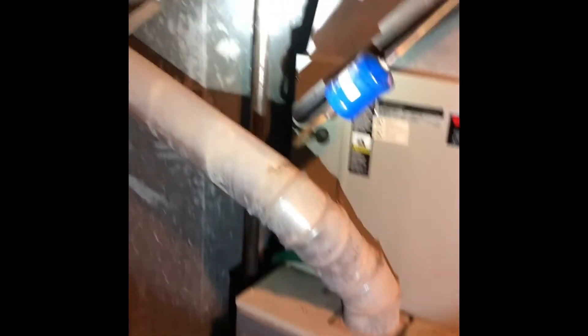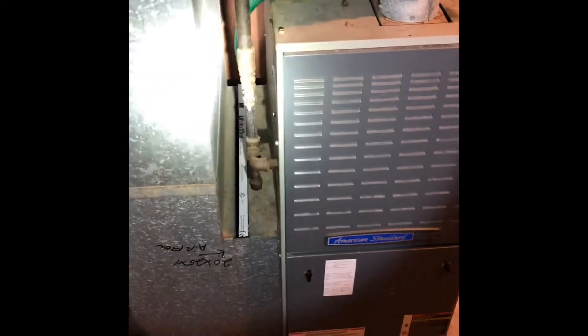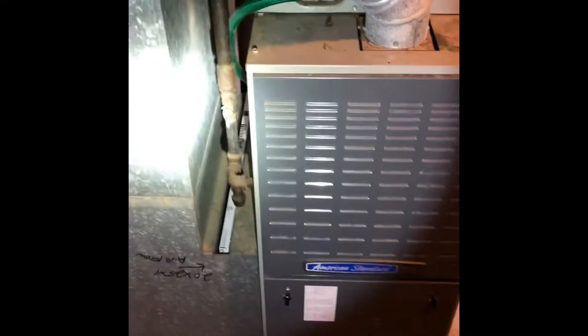Our electrical is okay on the side of the unit. Our refrigerant lines run out of the front of the unit and then directly up into the ceiling and straight outside. Gas line is okay. There is a shutoff valve here for the system, and I imagine a union is inside the cabinet there, so we'll just break it and build it back into the existing shutoff valve.